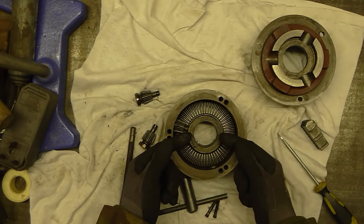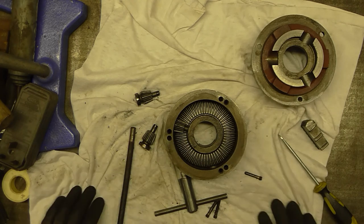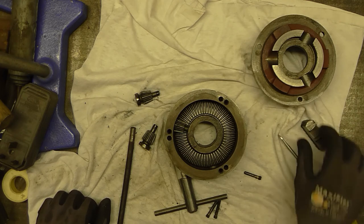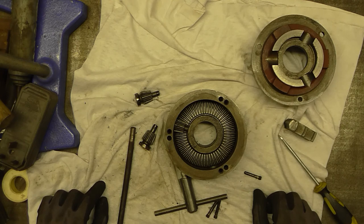As you'd hope, the pitch of the scroll is consistent, but of course they wear — and due to the way the teeth contact, they tend to wear unevenly. But they should in theory be repeatable, and this is where your soft jaws come in: if you bore your soft jaws at a given diameter you should get repeatable centering at that diameter.